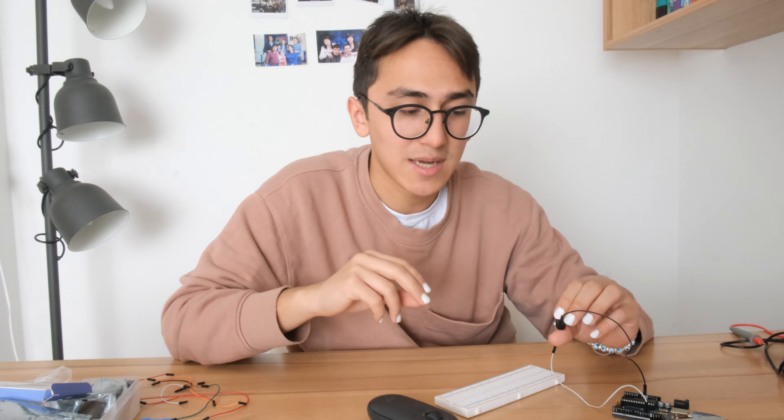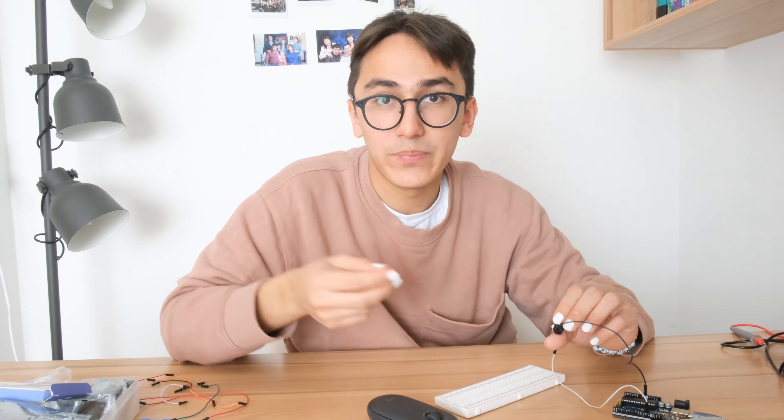The difference between active and passive buzzers: on the back side there is a black tape on the active one and an open green on the passive one. The active one has more circuits inside. An active buzzer has a built-in oscillating source — it will generate sound when electrified. A passive one doesn't have that source — you need to use square waves with frequency between 2kHz and 5kHz to drive it. The active buzzer is more expensive because of those built-in oscillating circuits.